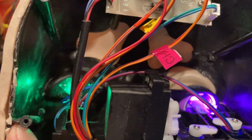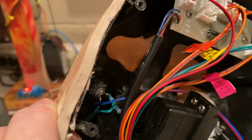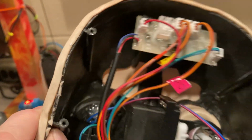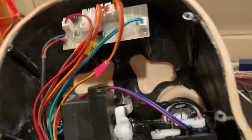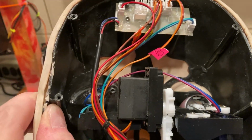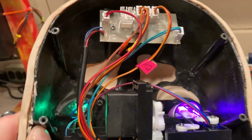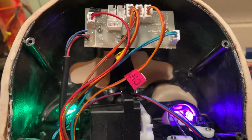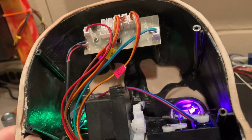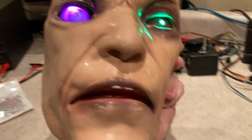So each one of the LEDs there, the green and the purple, are getting about 3 volts. That's after the two 100 ohm resistors there, because we're powering this all up with the SVI props, which run on 5.9 volts, either a 2 amp adapter on the normal ones, and usually the servo props that SVI has require a 3 amp 5.9 volt adapter.